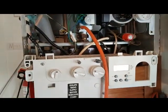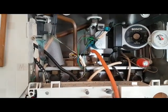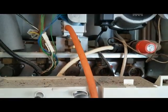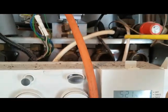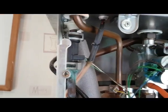On this particular boiler we're going to look at the hot water function first. In hot water mode, what you've got is the cold water inlet which goes up to the main heat exchanger. This is the cold water inlet — this pipe here — it comes in through there, goes along the back, and this is the flow turbine, going up through that flow turbine and up into the main heat exchanger.